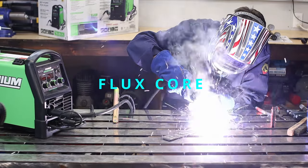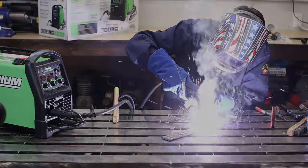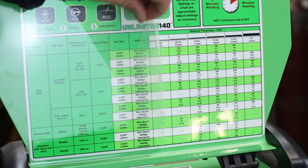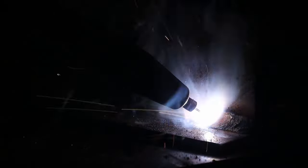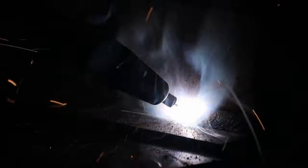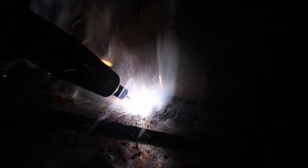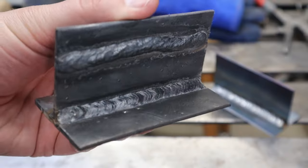Right off the bat, I hooked up the flux core wire — I usually like starting off with that. I've got some eighth inch material doing a fillet weld on a T-joint and it's laying down pretty nicely. I followed the settings directly under the hood with no adjustments, and I don't think I would change anything either. Since it didn't come with wire, I already had some Vulcan .030 thousandths, so I used that — it gives me the biggest range of material. If you're unsure what size to get, I'd always suggest going with .030.